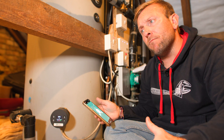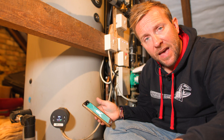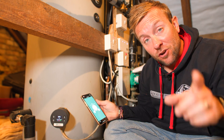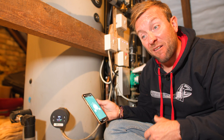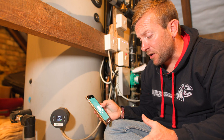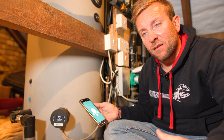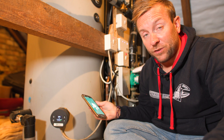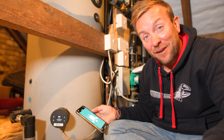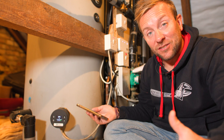I haven't used the Smart feature myself, and I think a lot of people who are going to be installing this might think about using Smart — it's a nice feature to have there, but I haven't used it myself because of the way I use my immersion heater. If you have, why don't you comment below and let me know what you think about how it worked. As you can see, when we set it onto travel, it sets us at a set point of 10 degrees to make sure that everything's okay. For me, the best takeaway is the fact that I can monitor the hot water tank temperature from my phone, but also that I can just turn this on and off really easily without having to come up here and flick that switch. I can just do it from my phone — it's always wired up, ready for me to use.